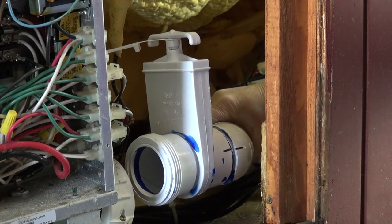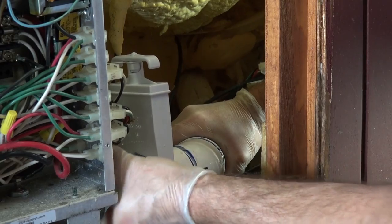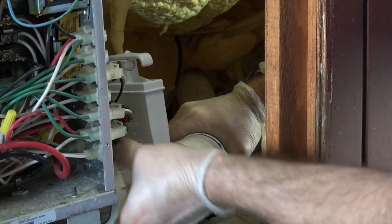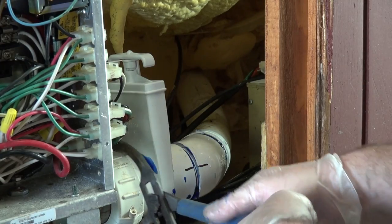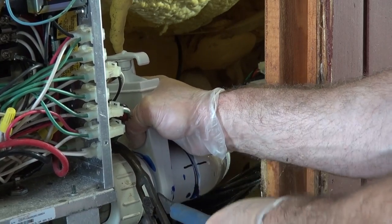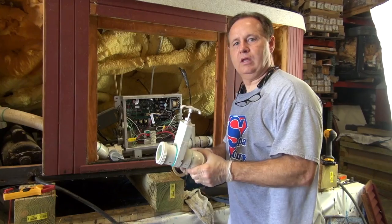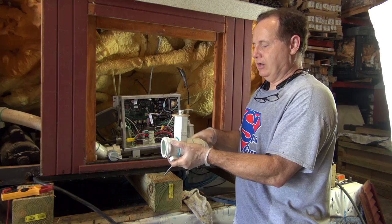All right, so I'm going to put my gasket on. Make sure your gasket's in the groove and lined up nice. I use oil filter pliers to tighten it. Open my slice, put the keeper in place — if you don't put this keeper in place, this thing can vibrate closed and create a flow code. So there you go, friends — I replaced this part right here that was messed up, where that pulled out and that stayed closed. Another completed repair.